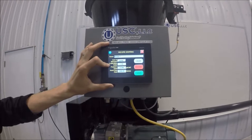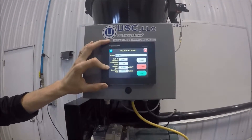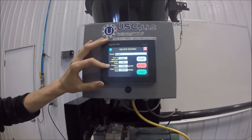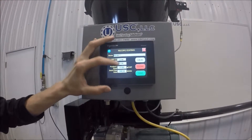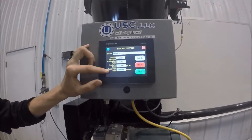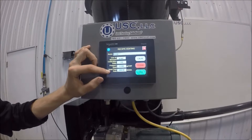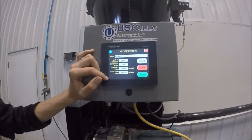Next is calibration ratio, which we'll get to in a minute, followed by product per seed — that's how much product we're going to put on per seed. Today we have it set up for 22 grams per 100 weight. Lastly is seed flow rate; this is the flow rate of the treater you're running. I have our treater set up for 1,000 pounds per minute.